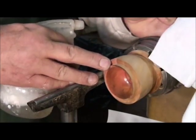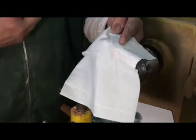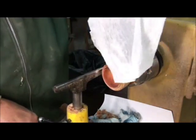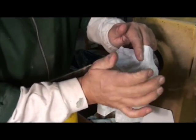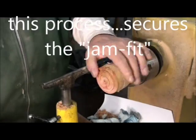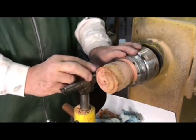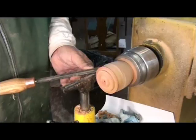Say that my lid is a little loose at this point but acceptable for my final fit. I've got a bottle of water and a tissue — I always have water available. I'm going to wet that down, put it over the spigot of the base, put my lid back on there, and take the excess tissue away. That's going to help the jam chuck hold. I find that on a lidded box like this I don't really need to bring my tail stock up.